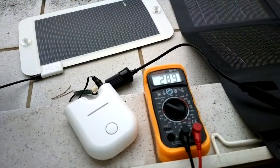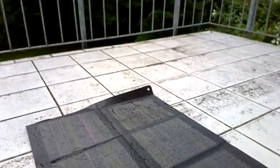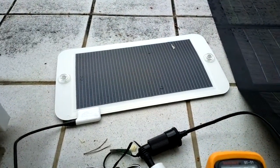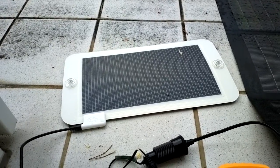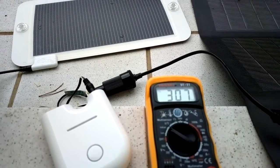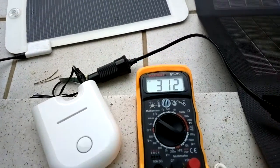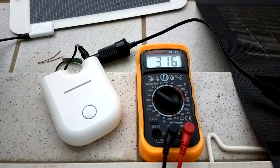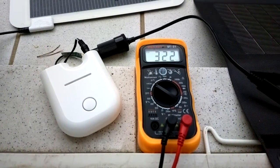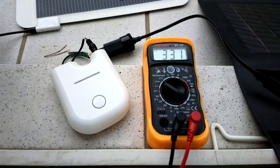It's Chippy here and I've got the Changers solar kit in front of me on an extremely dark, dull, miserable day. It's even been raining, as you can see on the 25 watt Sunlink panel. The reason I'm doing this is because the 4 watt Changers solar panel isn't going to pick up anything usable in this low light level. The lux meter is reading around 3000 lux, which is really nothing — cloudy-day lux levels, possibly less than you'd get in an office — representing something between a 20th and a 50th of the energy you'd get from direct sunlight.